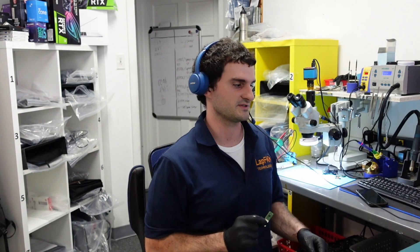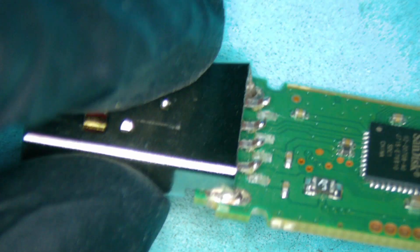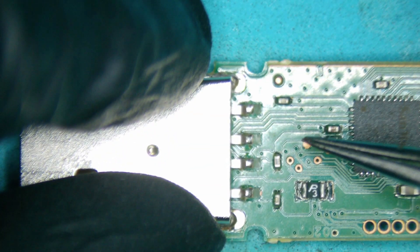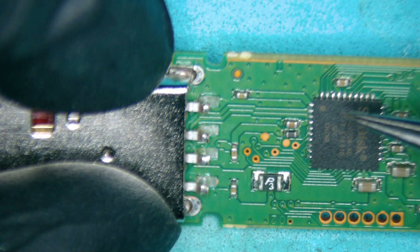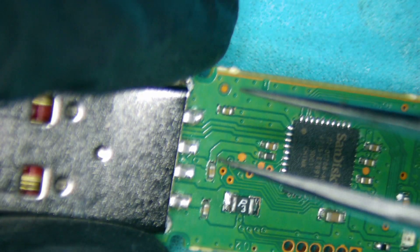I can kind of see the damage, but it's better if I put it under a microscope. So here's the USB — you can see the physical damage. These four connectors are lifted; they were actually connected to the board here. These are pads that were underneath, and those pads connect via trace lines — you can see these little lines going along here. They go to the SanDisk chip, and they can carry power, data, or other signals.